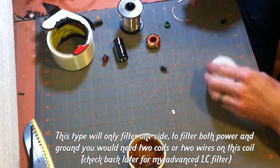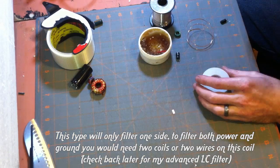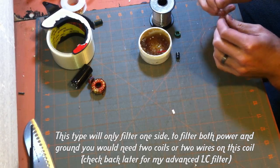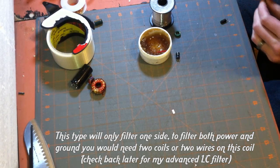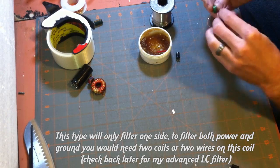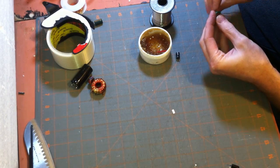You're going to need some magnet wire, your capacitor, your ferrite ring, some solder, and some flux. This is how the magnet wire normally comes — on a spool. The first thing you'll need is to wind your inductor. I don't really have a set number of turns — just whatever we can fit on the ring. I'll cut a piece and wind it up; just keep passing it through until it fills up or you run out of wire. I'll fast forward until I get done with this.